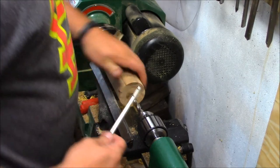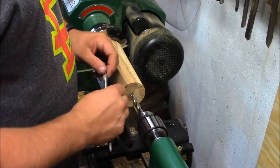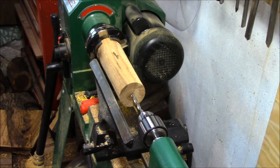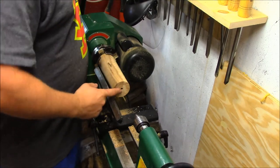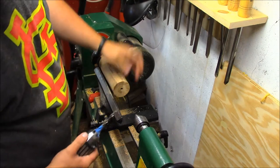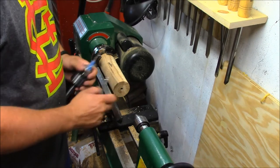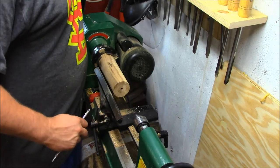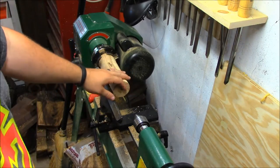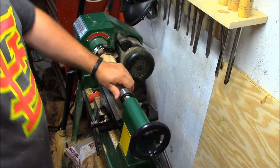To start on the handle, I've got a nice cylinder roughed out in my jaw chuck. I don't want to go in too far — probably about two inches, maybe three at the most. I drilled out a hole for the screwdriver shaft about two inches deep using my drill chuck. Unfortunately my battery died so I didn't get a shot of that, but it's pretty self-explanatory. Now I'm going to bring out the tail stock, secure it nice and straight, and get started on the construction of the actual handle.